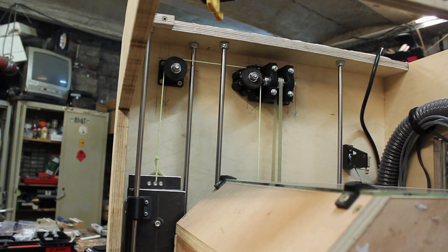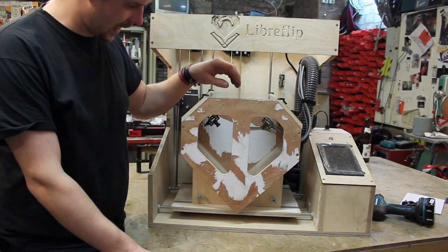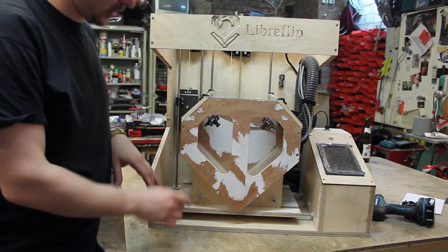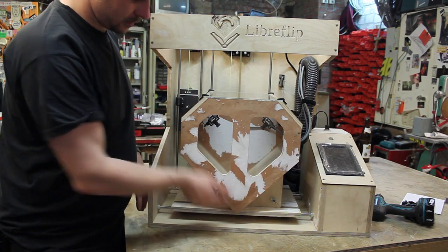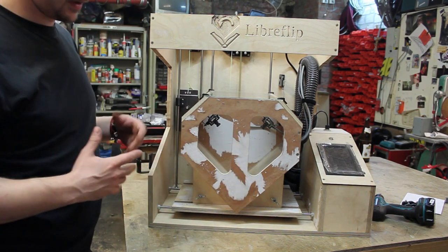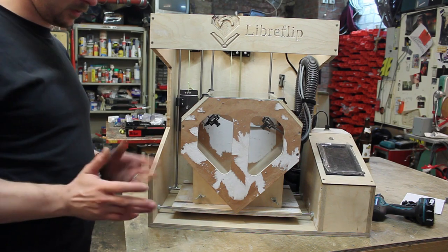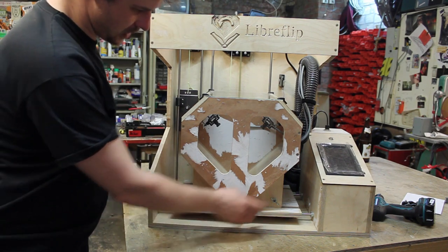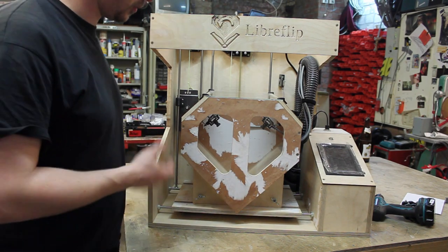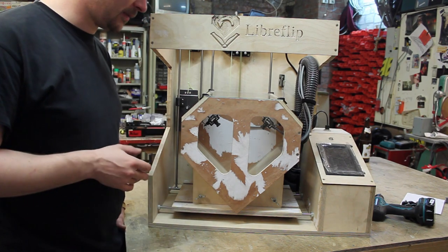Let's continue making the light. The light has to go up here on top of the glass, providing some light through the glass. This is important because these two glass panes, this one and this one, the surface can be imagined to act a bit like a mirror. And two mirrors positioned like this actually form a so-called retroreflective mirror, one that sends the beam back in the same direction where it came from.